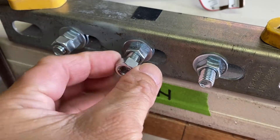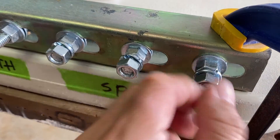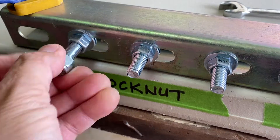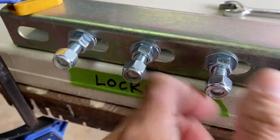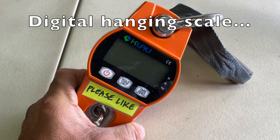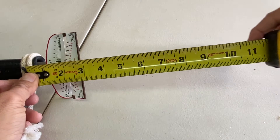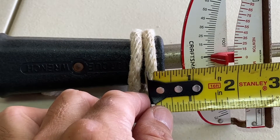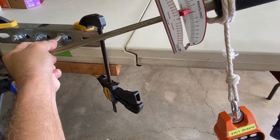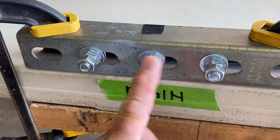Three samples for plain nuts, split lock washers, internal tooth lock washers, and lock nuts with nylon inserts. We use this deflecting beam torque wrench and digital hanging scale. As covered in an earlier video, the distance from this point on the handle to the center of the head is 12 inches, so the pounds reading on the scale will be the foot-pounds of torque. All the nuts will be tightened to 13 foot-pounds and the breaking torques will be recorded.